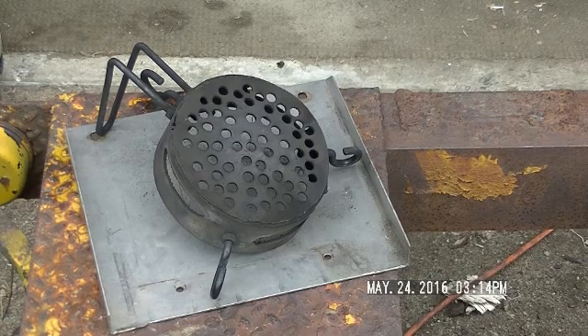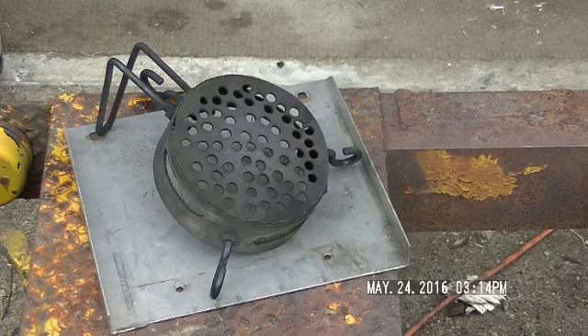I think I've figured out the problem - the sides are too high to allow the charcoal to excavate out of the way to make room for the new stuff making gas down through the inverted bell and down through the hearth. Once it gets past that point and packs around the outside, it's not burning anymore - it's just plugging everything up and not allowing everything to move through.